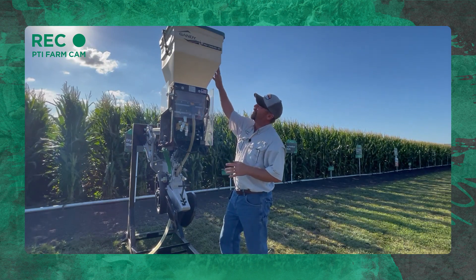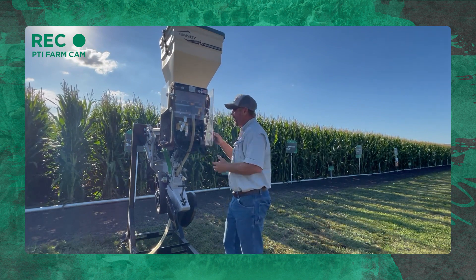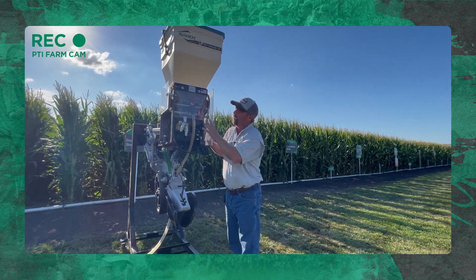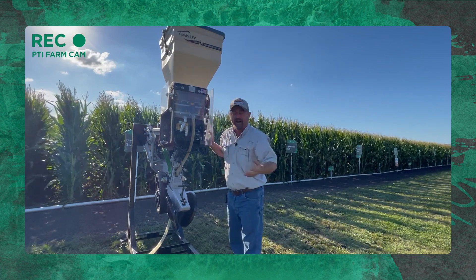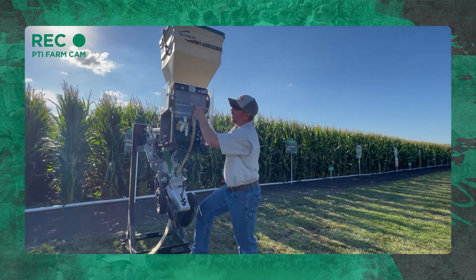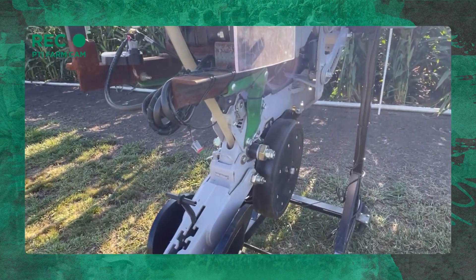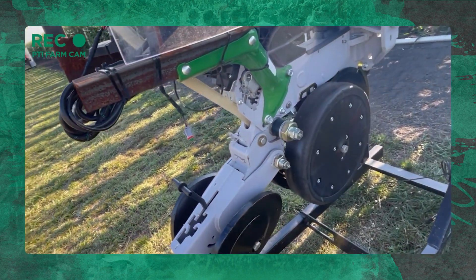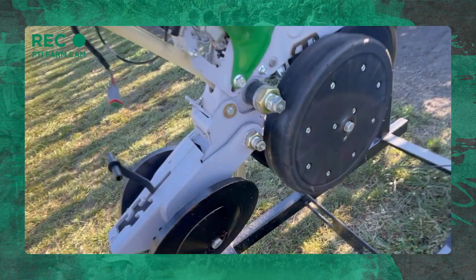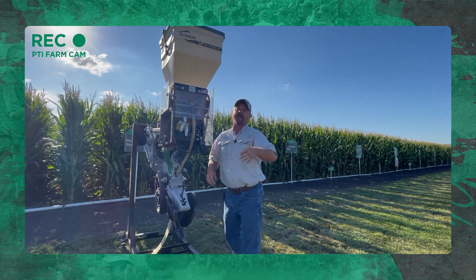We went to Gandy and got this poly tank that we're putting on the back of the planter — this is where your soil-applied insecticide box would fit. We had an orbit motor on this thing and we're well overdone; it's high capacity. To put five and ten pounds on this is a little bit overdone, but it did a really good job of applying products. We've got a paddle wheel up here that takes product from the tank and puts it into a drop hose going all the way down, feeding it through the row unit. The product comes down the hose and feeds right before the closing wheel, so we're getting a little incorporation — it's still a band right over the planted row.